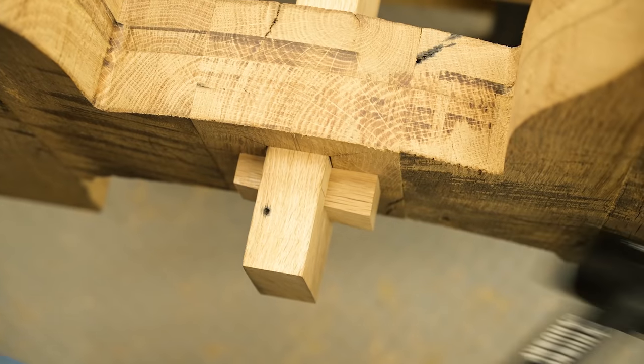All right, you might notice on the ends, I wiggled it some to elongate the hole. That was not for its pleasure. That's so when I put the dowel in there, as the table expands and contracts throughout the seasons, it's going to move this way. Whereas this breadboard, the grain is oriented perpendicular. Whenever you have perpendicular wood grain, that's when wood movement may become an issue. So having that hole elongated means that this little dude gets to go, whoa, and slip around in there as it needs to while the table moves, so we don't have to worry about it cracking itself or anything.